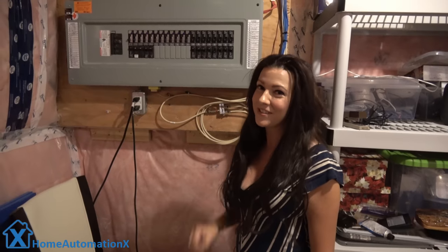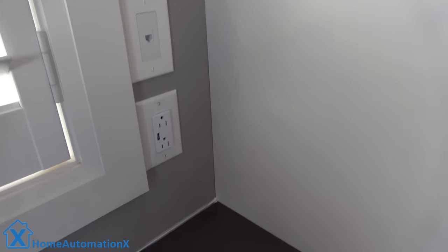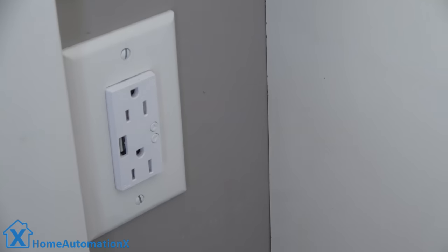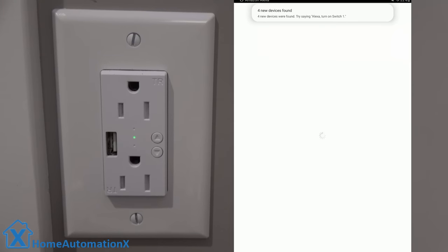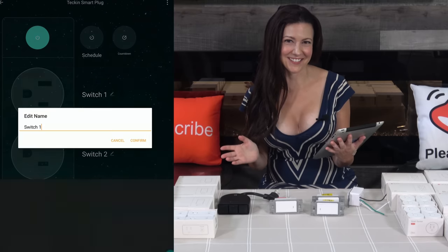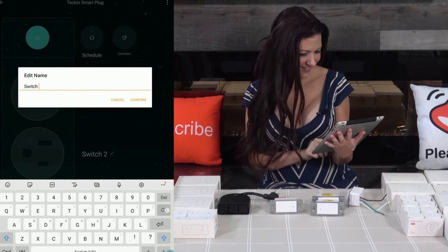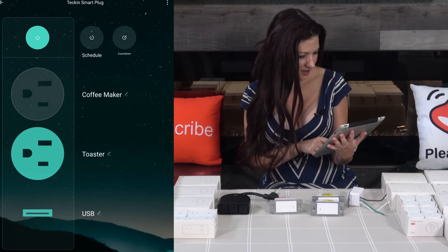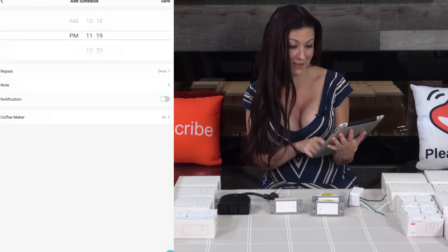We're back in the basement. We've reinstalled it and now we're just going to turn the power back on. We are going to use the Smart Life app for everything we use today. Make sure there is a flashing light that shows it's ready to pair. If it isn't flashing, hold down the button for seven seconds. I will wait until it starts to flash, then go into the app and select auto scan. It will show up and I will follow the screens to enter my WiFi network information. I'm going to name the top outlet 'coffee maker' and the bottom one, maybe 'toaster.' Leave a comment and let me know what you have plugged into your kitchen. Now I can control them separately in the app and also turn the USB on or off. I can easily create schedules so I can have that coffee ready for me in the morning on any day of the week.